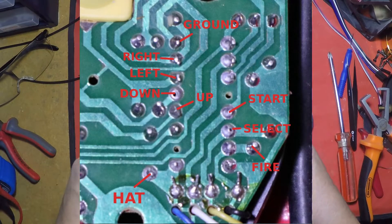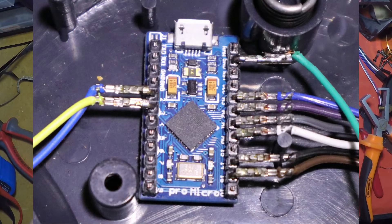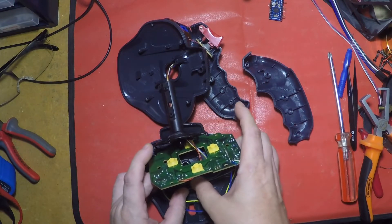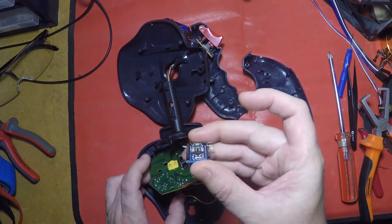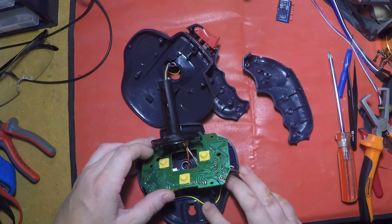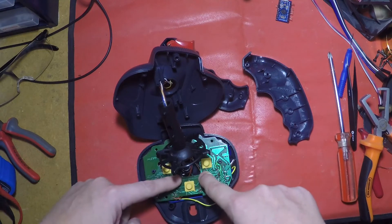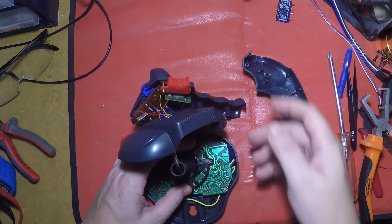If I take a bit more care — I've just lost one of the cables. That's a bit of soldering work I've got to redo. So I took all the components off, including the chip that was here doing the controlling, and basically soldered everything through. With the pins actually bent sideways, it gives it enough of a low profile that it will sit beneath the board, so the board should be able to come down. I need to do this a bit more carefully. The board will come down, sit here, and that will happily sit there with the Arduino Pro Micro underneath it. Then that can fit in and the whole thing can be reassembled.